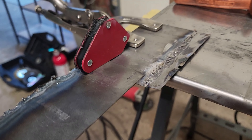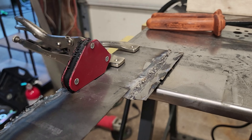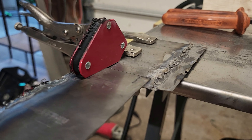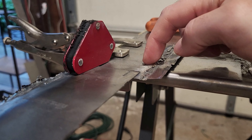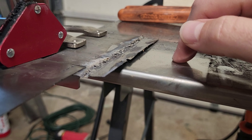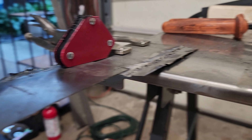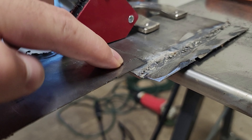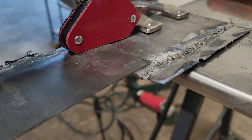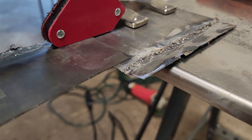For now I'm done fiddling with my T-joint. I'm going to try this lap joint now. I've learned from several tutorials that when you're doing 22 gauge steel or something really thin like that, it helps to actually weld on top of a thicker metal — it kind of tricks the metal into thinking that it's thicker. I'm trying to learn this so I can do it on a body panel, which is going to be pretty thin anyway.